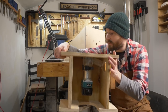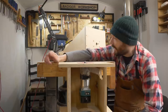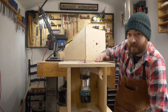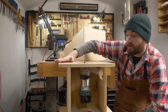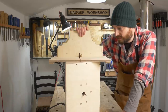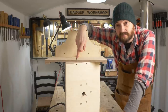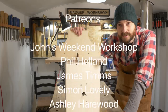Last year I made this simple router table that just slides onto the end of the bench on a couple of brackets. Now this, as you can see, goes into the vise, or I could add some brackets and it could do exactly the same on the end of the bench — the only thing is I'd have to have it sticking up a few centimetres so that the sled wouldn't bash into the bench top. So that's it all done. A pretty simple router jig for doing box cuts. And obviously you could make different sleds that have different sized slots, different sized bits to do different sized fingers. Anyway, thanks for watching, thanks to my patrons and please subscribe for more videos.